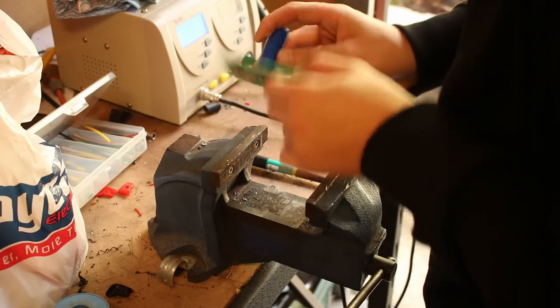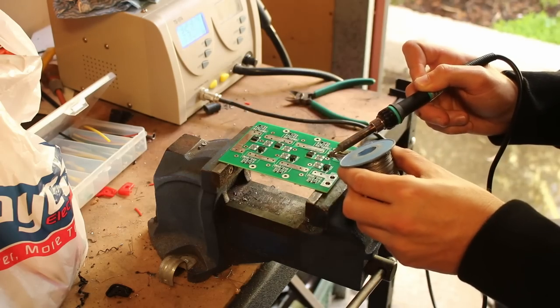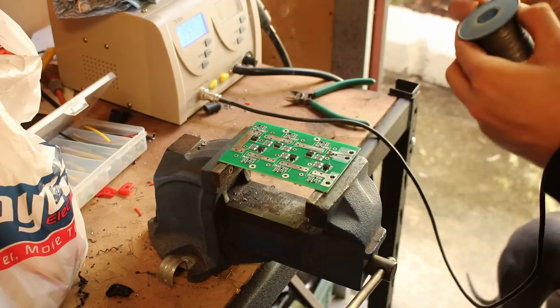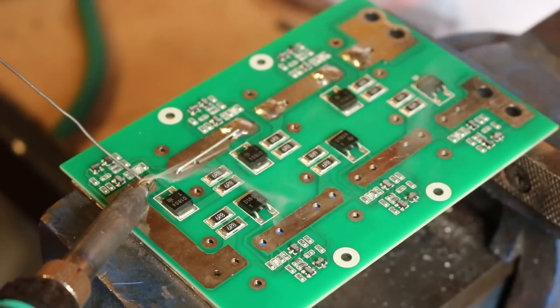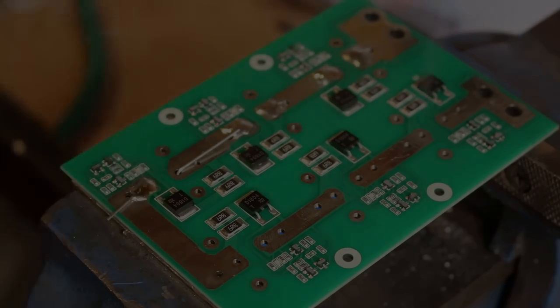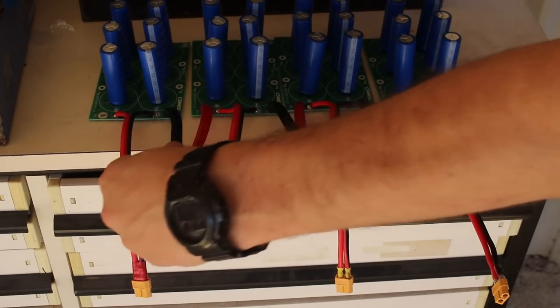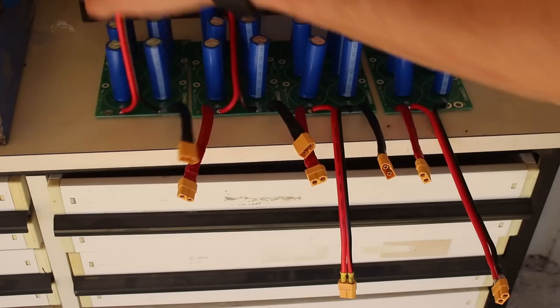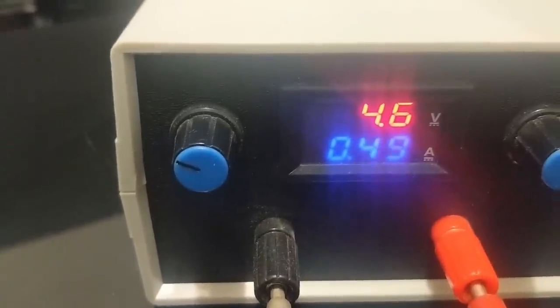The balance boards take six capacitors each, and the onboard circuitry tries to balance the input charging voltage across each super cap and will not allow it to exceed 2.7 volts per cap. With six caps in series on each board, we get a total maximum output voltage of 16.2 volts. I've soldered on some charge and jumper leads to make it simple to charge and connect the boards in series, using XT connectors for easy connection and current rating. To charge, I hooked the board up to my power supply with a 1 ohm, 100 watt resistor and slowly increased the voltage — you can see the current decreasing as the super caps charge up.